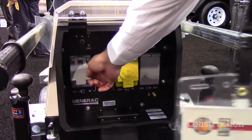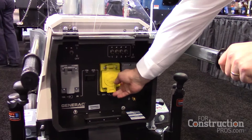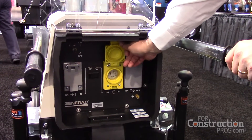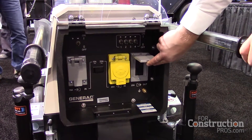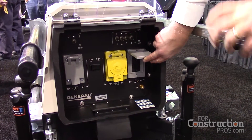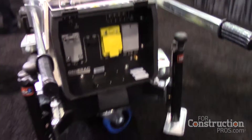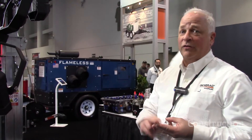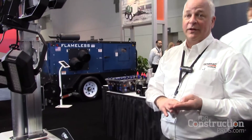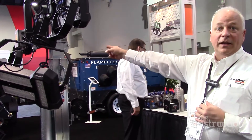The beauty of this — the link tower, as we call it — is if you want to run two of them, you run a 20 amp outlet, plug in here with your cord, hook the second cord in here, daisy chain it over, and run your cables a distance of about 400 feet away per unit. Using the proper cables, either 12 gauge or 10 gauge for 15 amp or 20 amp respectively, you can have two of these units running off of one outlet at 20 amps.